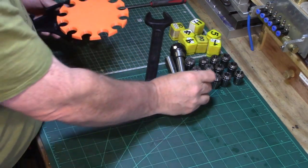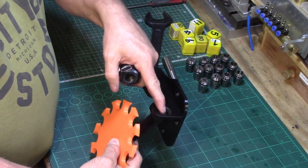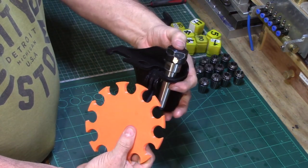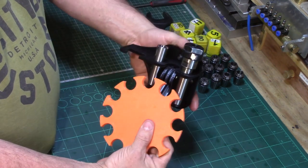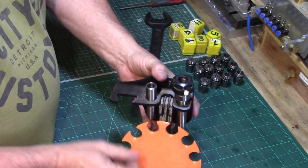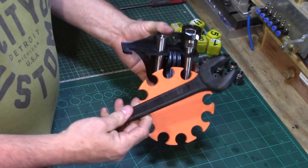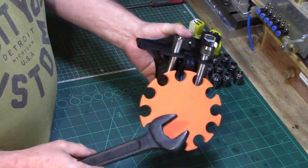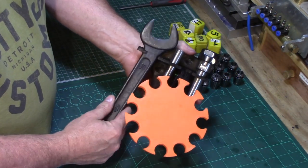On the top of the mounted plate there are two tapered holes which have been designed to suit my Morse Taper 2 collet chuck and an additional hole for other MT2 accessories such as my half inch taper collet. Also on the top is a slot designed for a collet spanner. In my case I use a 30mm spanner to suit the hex on the collet chuck and that fits nicely into the collet spanner slot, which will hopefully mean that I won't lose it quite so often as I do now.